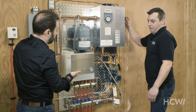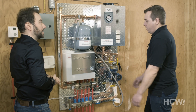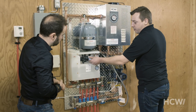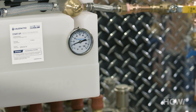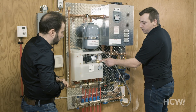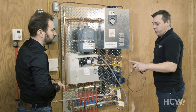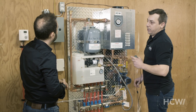Filling the system basically involves filling it with water, and the injector is what pumps the water into the system. If we look inside, there's a small pump right here. Its job is to build pressure in the system, which will remove air at the same time. Before it left the factory, it was set to reach a pressure of between 12 psi and 15 psi. If the pressure ever falls too low, we can always adjust it by turning the screw a little bit.